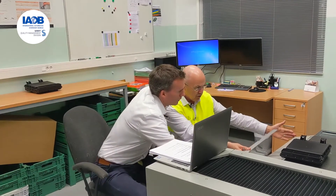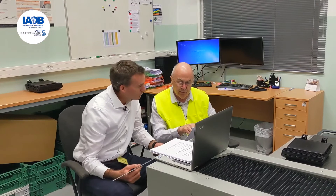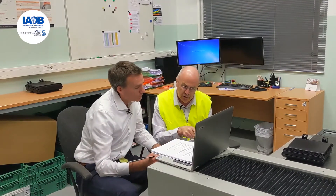Okay, so let's just try one more. I saw this ruler was being used to measure the length of this product, and again that is referenced back on the control plan. What's the smallest graduation on this ruler? Millimeter, so we can measure to one millimeter. Okay, and what's the tolerance — show me the tolerance on the control plan. The tolerance on the control plan is actually plus or minus 0.5.